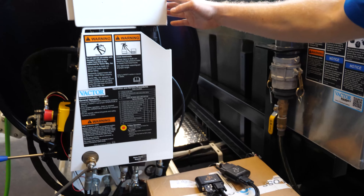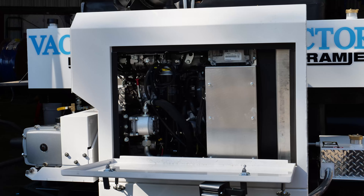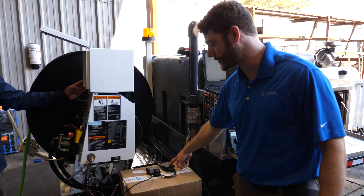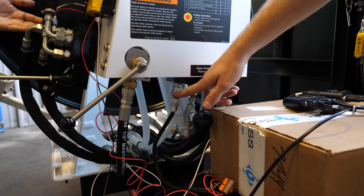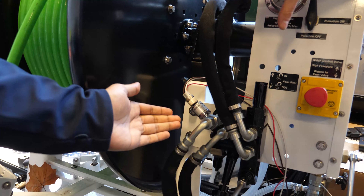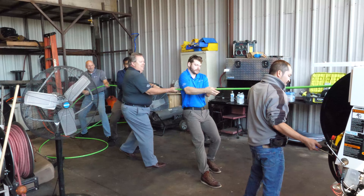This is our instrumentation kit right here. We're using a CAN data logger which measures J1939 engine data, tapping in right here in their control box — that way we can measure engine speed, engine torque, and load. We're also using an analog-to-CAN module which takes in analog pressure data from our pressure transducers, measuring the nozzle pressure of the machine, as well as a pressure transducer up here which measures the hydraulic motor that runs this reel.